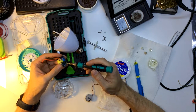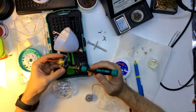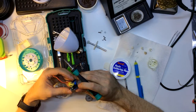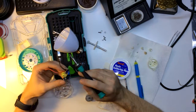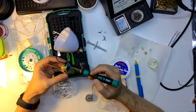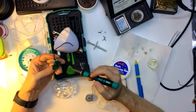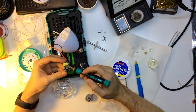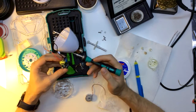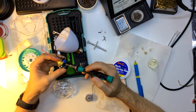So this capacitor charges up, probably turns on this chip. This is some sort of LED driver chip. I was not able to find any data sheets for it online, but it is labeled H7122DS. The only sites I could find anything about it were Chinese websites, and they didn't have data sheets on it. So that goes over into a pair of components that are underneath this transformer. I have no idea what happens after that, because in order to find out what those components are, I'd have to take off the transformer. And that's just getting way beyond anything I'd ever want to try to do.